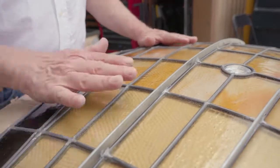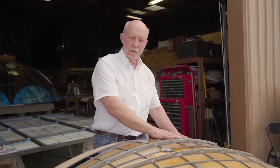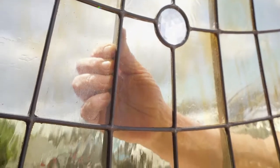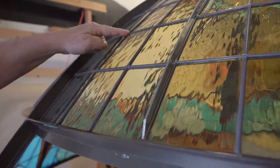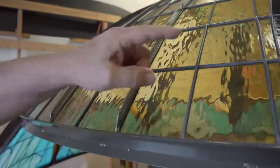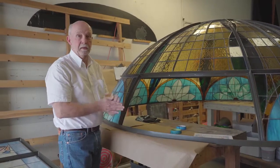The reason you won't see a dome panel with one long piece of glass is because you don't want one long flat piece — you don't get the curve that way. We get the curve by having smaller pieces of glass divided by lead, so we can just bend the whole thing. You've got the frame, you've got the lead, then you've got a steel bar for bracing, another steel bar, and lead throughout, all building and holding the whole thing together.